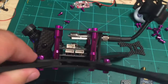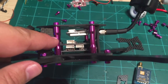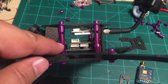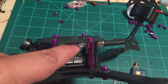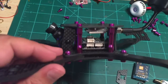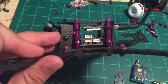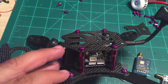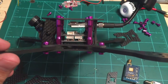Along with that, I also made the whole stack height taller. As opposed to the 25mm standoffs of the original design, this one uses 30mm. It's a little bit taller, which gives you a little bit of extra room to squeeze your receiver in there now that you've got your VTX in there as well. As a consequence of that, the camera mount also got taller, and the camera angle max adjustable tilt is somewhere around 55 degrees if you were to slam the camera all the way up to the top plate — so it's an improvement in that area as well.